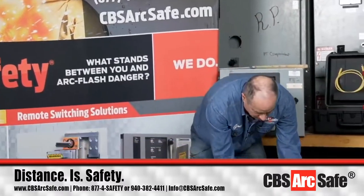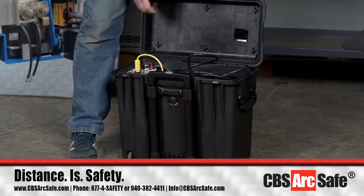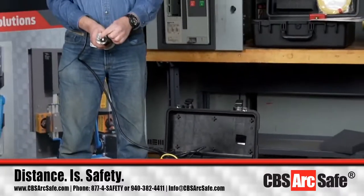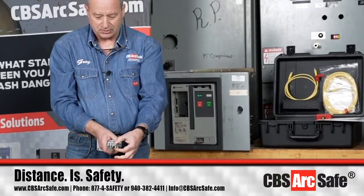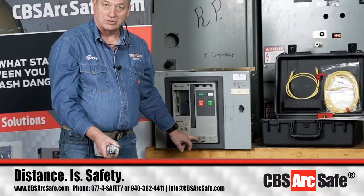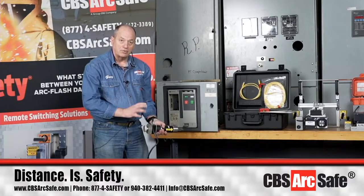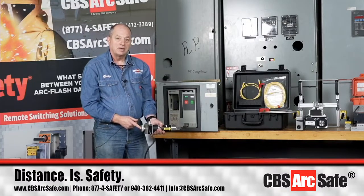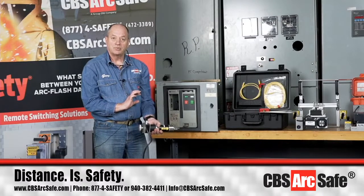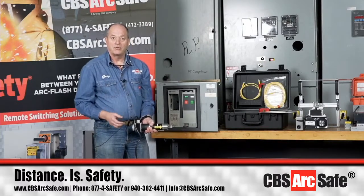You can tell that it comes in a Pelican case. You'll get a set of operating instructions with it. If you've used our DSR-1 at all, it'll look very familiar in terms of the on/off control switch and the charging. You've got your racking head motor right here. With the racking head, you'll notice we've got the 3/8 inch square drive and then this large steel locator, and a small clip. This clip goes into the hole on your lockout tagout. If this is not lined up properly, you have to rotate this knob back here manually, right or left, to get it into the proper position. It's a geared ratio, so it may take four or five turns to clock it to the proper position. So when you're first installing this on the circuit breaker, you need to check to make sure that the racking system is lined up properly, and then it's going to go in all the way like it's supposed to.